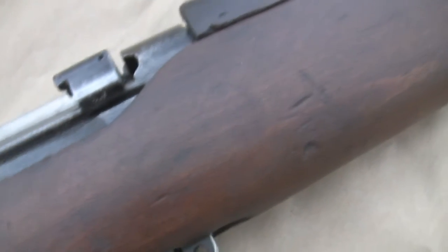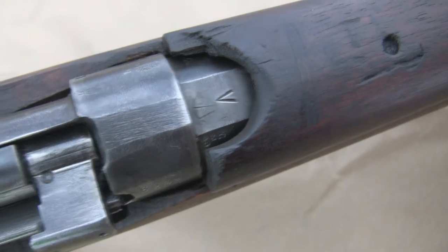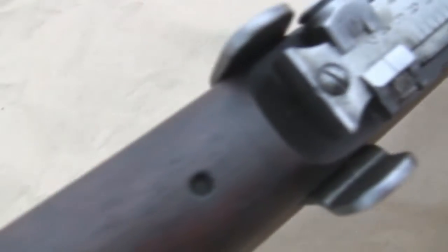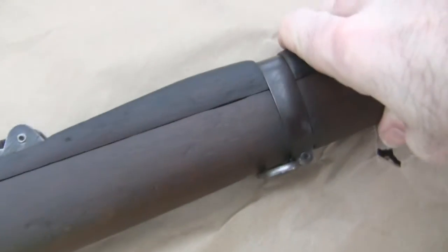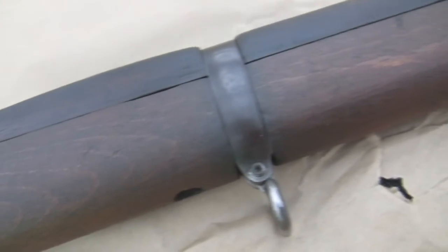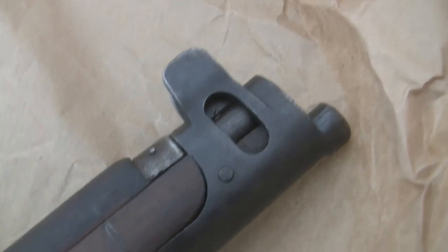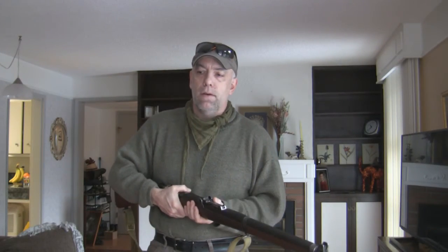There are other ways of lifting a dent. A lot of people will use a steam iron — you get a wet cloth, put it over the area you want to lift, apply the steam iron, and you impregnate steam into the wood. That's a good way of doing it. However, the way I'm starting to evolve is that every dent is probably a story. You're not going to be able to restore a dented stock to its former glory — those dents are there to stay unless you actually replace the stock. It is part of the story of these rifles. Every scratch, every dent — we should try to get ourselves out of the mindset of trying to remove those imperfections. It is part of the collectability of the rifle. But there are certain things we can do simply to weatherproof it, take care of it, maintain it — and those are through boiled linseed oil treatment.